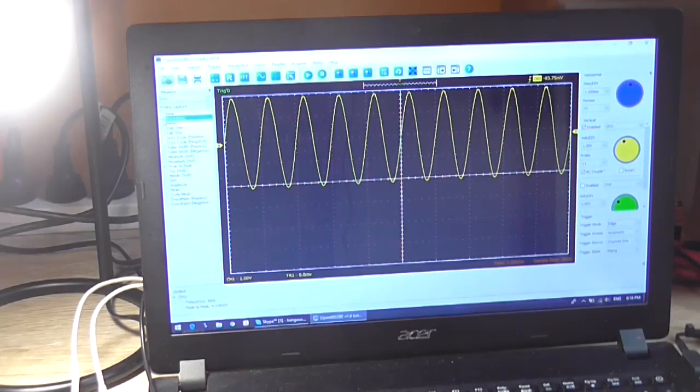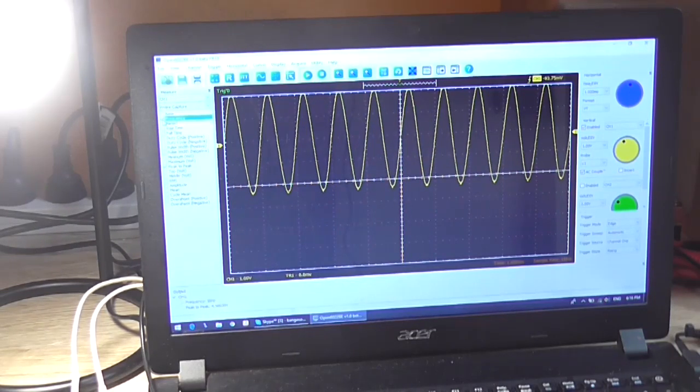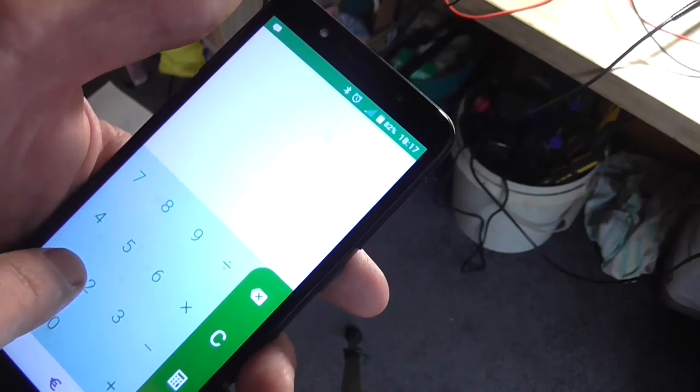Just going to quickly check my output stage. It's getting warm. What was I doing? Yes, doing the maximum input. So at 1.9, 2 volt, it's starting to clip. So I want to say around about 1.8 to 1.9 for maximum out. I'll ballpark it at 1.8. It's actually 1.9 now. We're getting 43.2 out, which in actual fact is a lot better than the breadboard version.